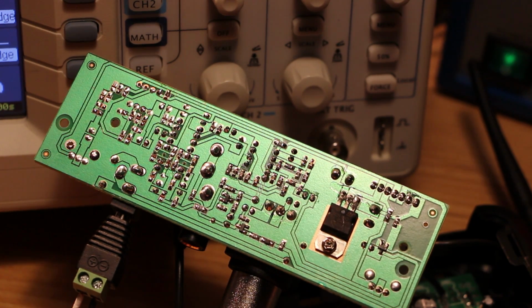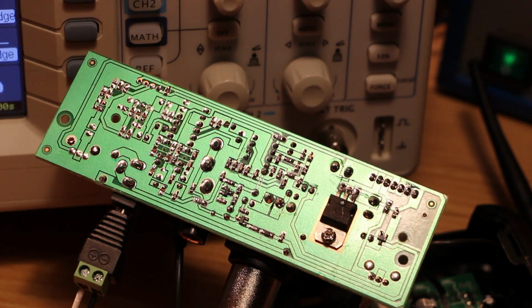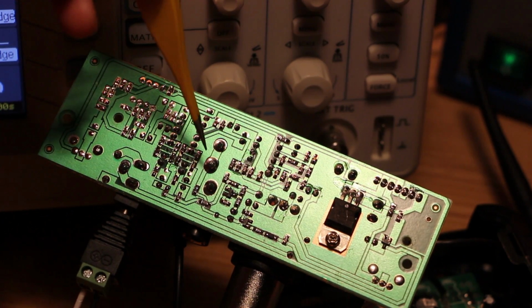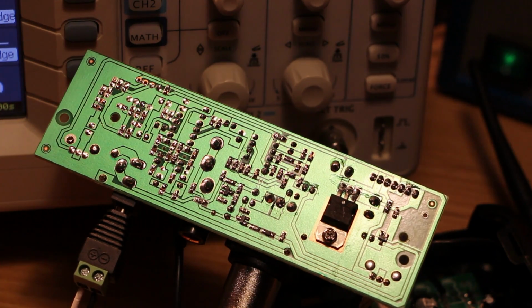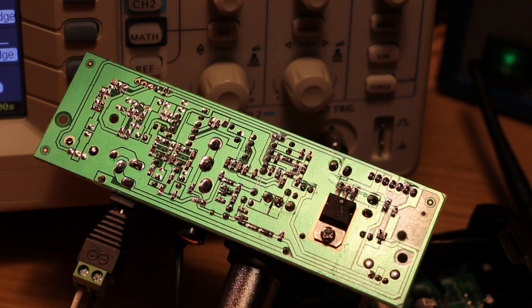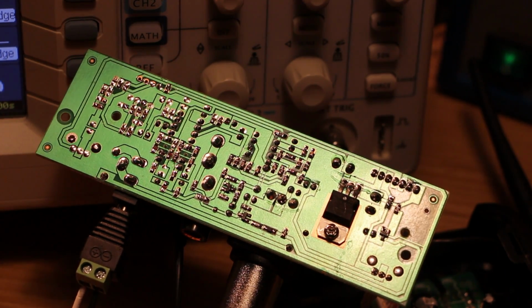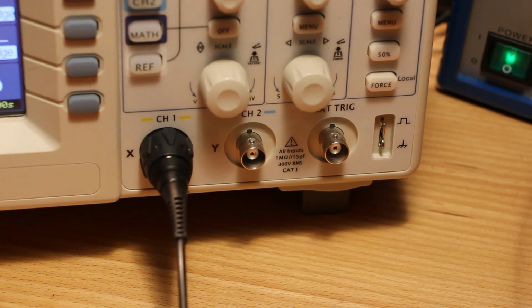And the two things that I thought they might need active circuitry for on this board are doing a proper balanced driver for the XLR output, or mixing in this auxiliary connector, which I guess is an input or an output of some sort. Doesn't seem like the active circuitry is doing either of those necessarily, so I'm clearly missing something at this point.